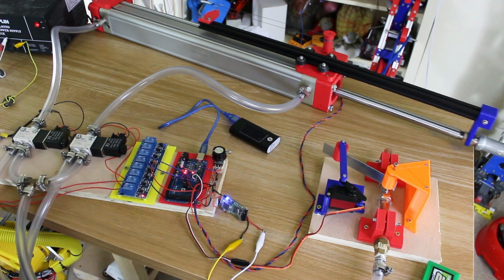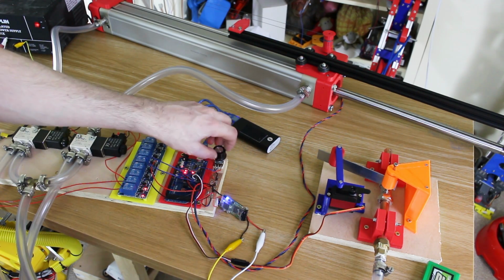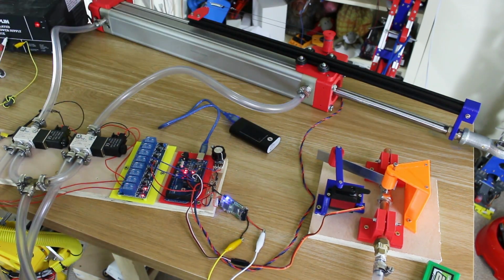Right. Good, there's a big proportional move, that worked. So moving one way is definitely better than the other way. Although it does work, but then it jitters. So yeah, pretty sure that's because we've locked air in the cylinder, and that's when it didn't work. So perhaps we could use this for speed control, but if we try to lock it down to nothing to stop the cylinder gracefully, then we get a bunch of issues again.